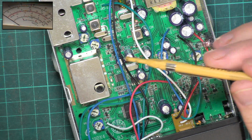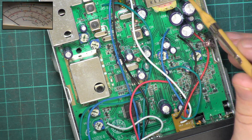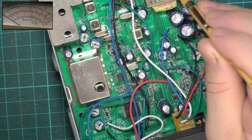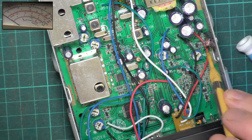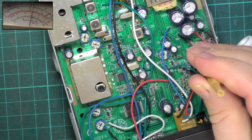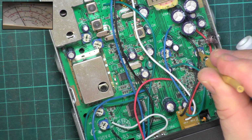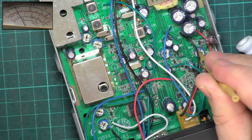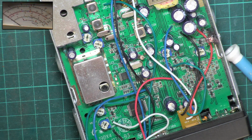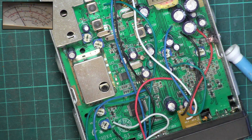Now it's the guesswork time. What's going to be power? Because this is going to be the AM modulation transformer when it's in that mode. So is there a preset near there? Is that a voltage regulator? So is that something which is going to affect transmitting it? Probably. Yes, that's it. Well, that was a good guess. And we managed to get about 3.2 watts out of it. So that's probably modulation.